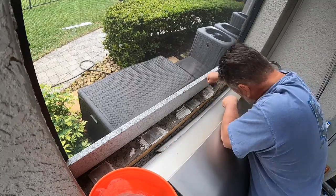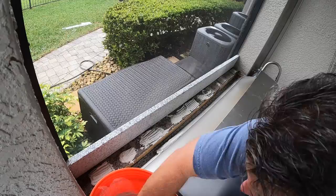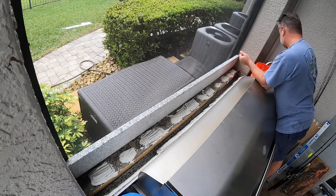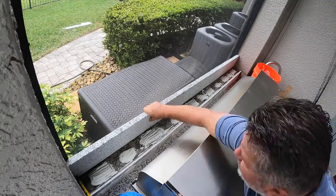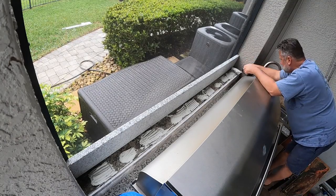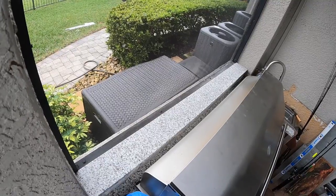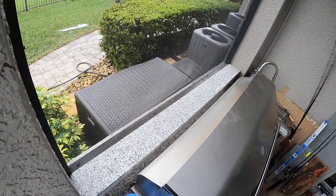What I ended up doing was piling up a bunch of mud on the right side, putting the sill back in place, and pressing it in until I achieved that half inch between the two sides. When I test fit it I realized I was still about an eighth of an inch too high. I originally had travertine stones as spacers, then replaced them with concrete board and mudded both sides — maybe eight or nine little chunks of concrete board. The sill actually slopes down on that side; there's more mud down there on both the backsplash and the sill. I loaded that end up with mud, and when I was happy with where it was I dropped the sill down and really had to shake and grind it in to get the mud to move and sit flat — it just came out perfect.